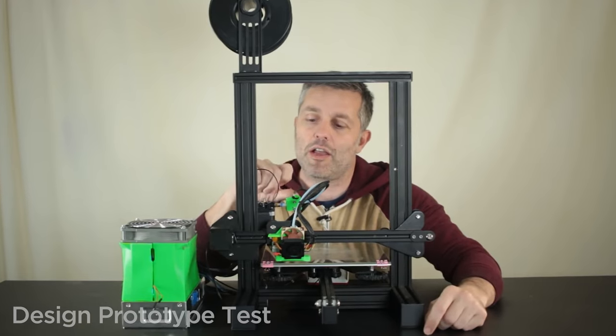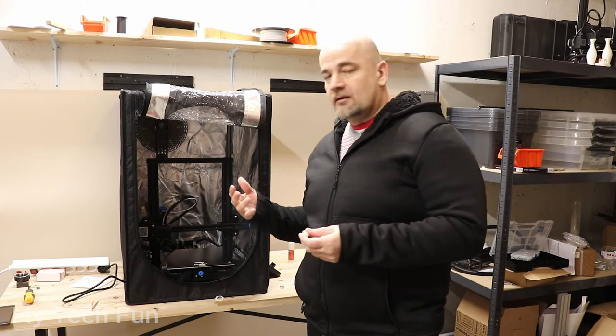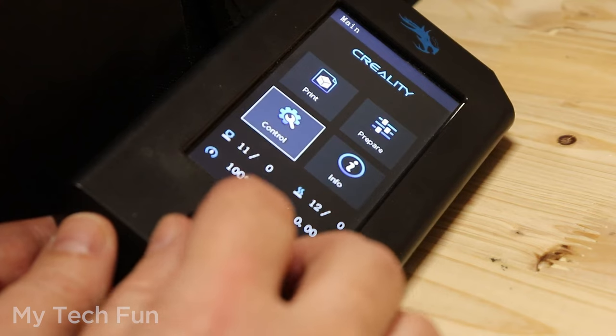The thing is, there's a lot of things about these machines that people don't realize — problems that come up when you're printing high temperature that you don't expect, that there's just no reference table for, and you don't see it coming. For example, if you take an Ender 3, upgrade all the specs — you've got a 200°C build plate, a 500°C nozzle, and you've built an enclosure with a heater heating it up to 100°C.